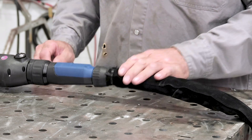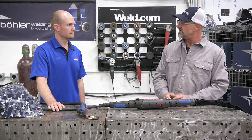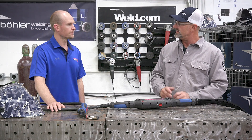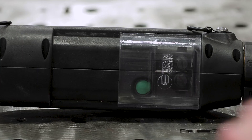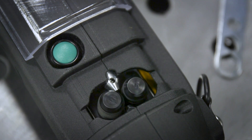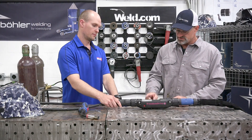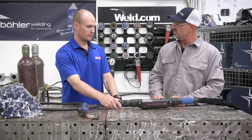I like the leather boot that covers all the cables. When you drag it across the floor or steel, it doesn't arc out, crimp the cable, or rip the insulation. The next major component is the main drive module. Inside there's a pull motor to assist wire being fed through the torch, which with aluminum wire and softer wires over longer distances can be an absolute pain. That solves a lot of the bird nesting in aluminum MIG gun welding.